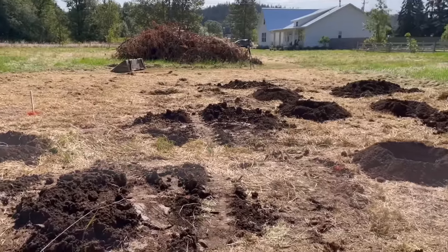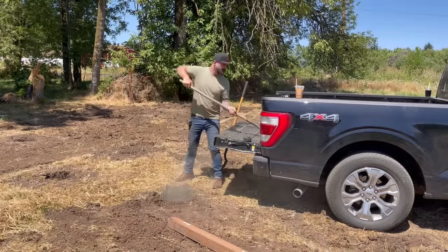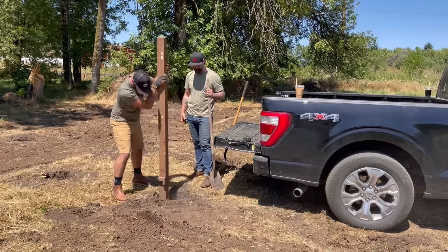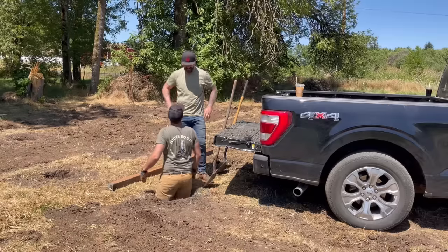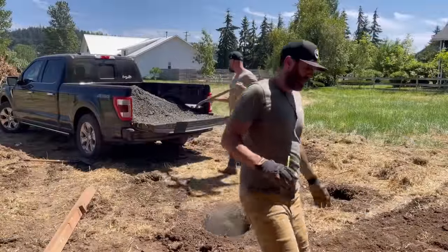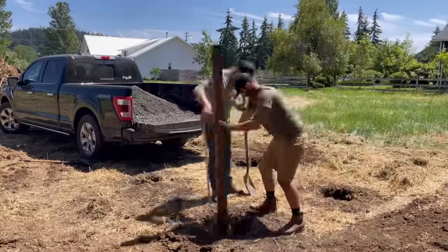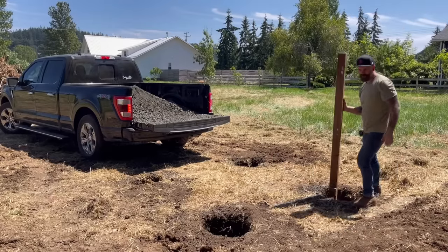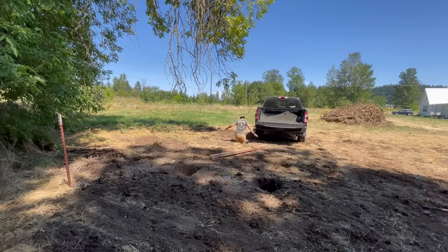It was time to go on to step two. I didn't know what step two was until I looked on the internet, and apparently step two when you're doing footers is to add a foot to a foot and a half of packed gravel in the bottom of each hole. This is three-quarter-inch minus gravel — the person at the gravel yard said that's what I should use. They also told me to use Craig to pack the gravel. So I started filling up the holes with gravel, roughly measuring here or there, and Craig would tamp it down. I just used a four-by-four piece of pressure-treated lumber as a tamp and it worked great. In no time I had all the holes filled with gravel, and Craig finished off with an interpretive dance.